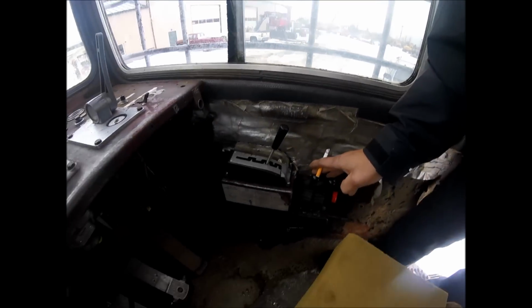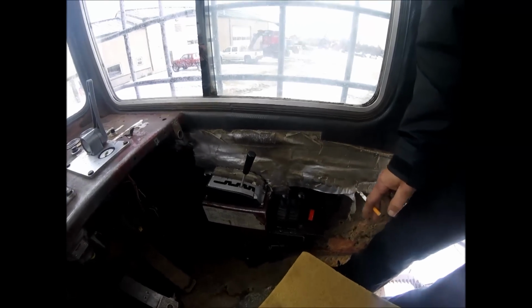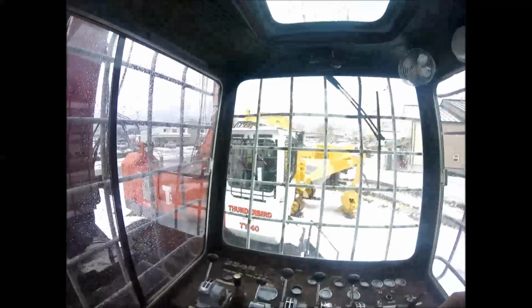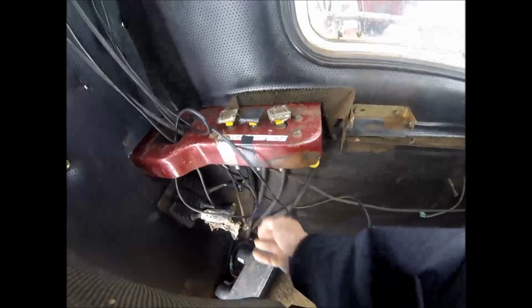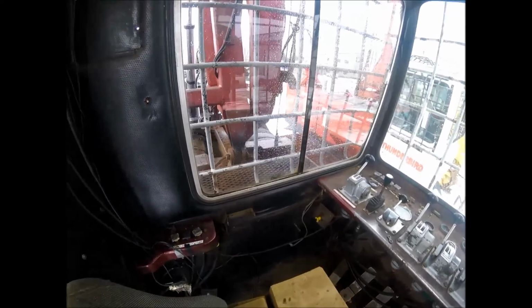Right here's the travel levers with its track mounted. We'll get out here in just a second, I'll show you that. Just giving you an overview of the cab. Actually a pretty decent sized little cab here. Here's our guy line dogs. They set in, you pop them out, and then here's the levers to function the guy line. It's a 3/4 machine, meaning it's got a 3/4 Skyline.